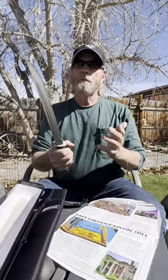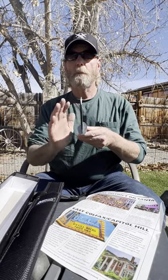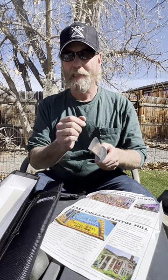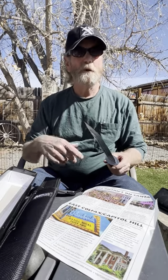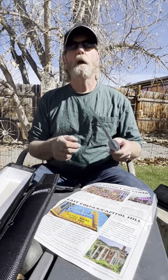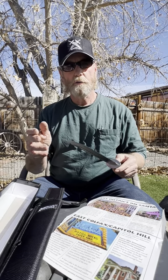If you're going to have a big knife that you might take to the woods, you don't want it six-thousand-grit sharp because you're going to tear that cutting edge up — the apex of the blade will not last. I don't even know why, if you have a six-hundred-dollar knife and you want to work on it for six hours to show people how sharp you can make it — I guess that's fine. But making any knife you're going to use, except maybe for meat on a wood cutting board in the kitchen, down to six-thousand-grit sharp, in my opinion there's something wrong with you because that edge will never hold.